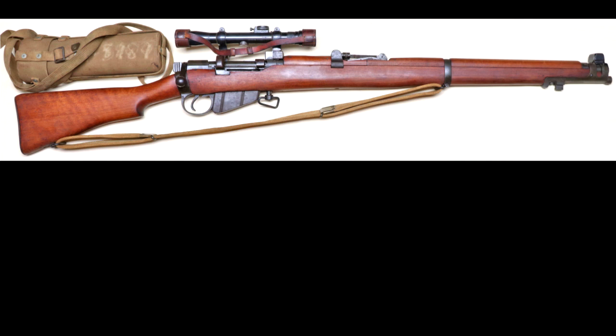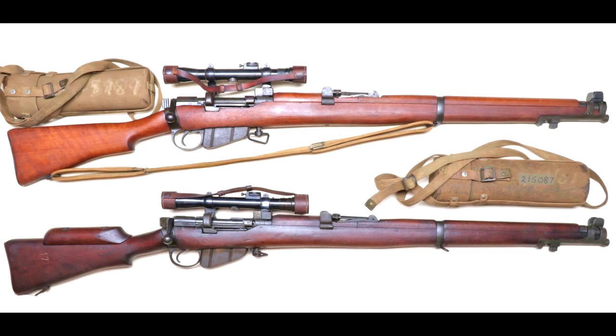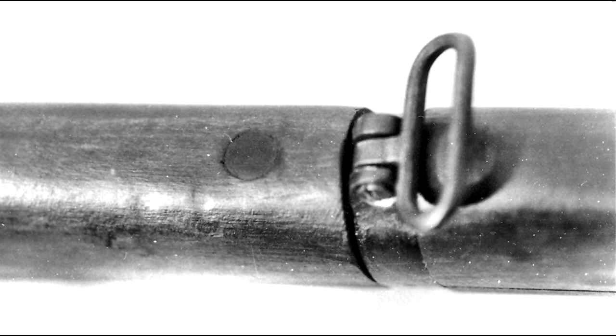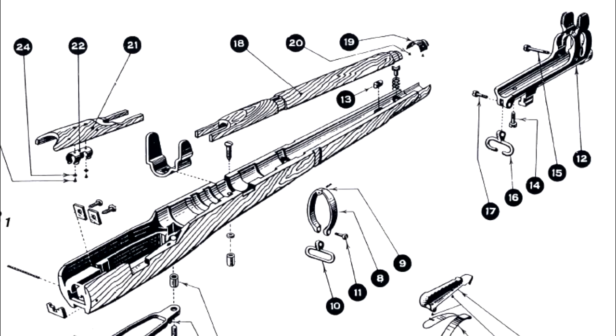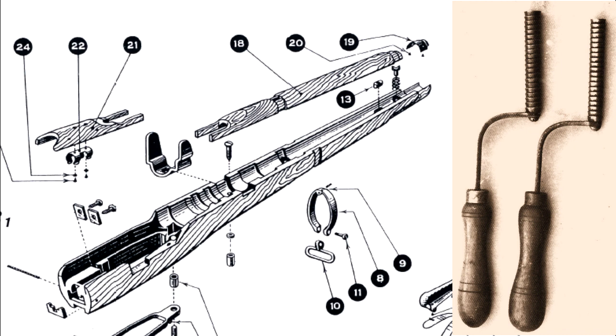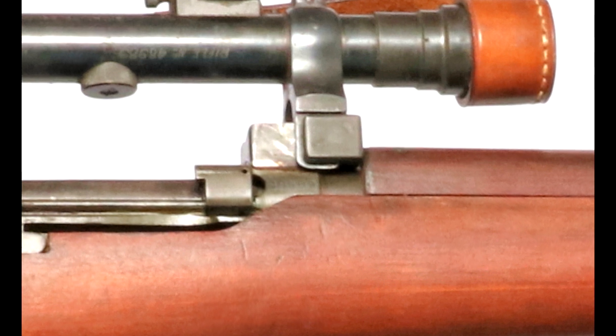The H heavy barrel rifles were fine-tuned and bedded, so in conversion to HT — or heavy telescope model — if fittings were to specification, no parts replacement was required. Some are noted with mismatching number nose cap, back sight leaf, or relative part numbers. Generally, a dowel plug was put into the forend where the barrel centering ring screw was located on the original SMLE. The inner band was not used with the larger diameter heavy barrel. The heavy barrel requires gouging out the forend barrel channel and modified hand guards. The rear hand guard has the back trimmed off to allow for the telescope mount.